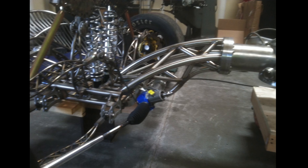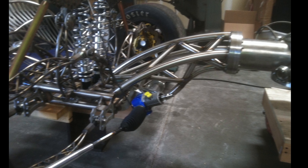That sort of thing was important the first few years since I didn't know jack about cars. The first order of business was to fabricate a truss which connected the forward-most vacuum chamber to the front suspension box. The initial confusion about how to deal with the pivot points of the suspension had been resolved, and now it was about structure — something which has far fewer constraints. The main reason the main truss member on the bottom dips down is it has to clear the steering rack and pinion.